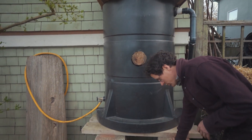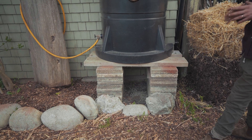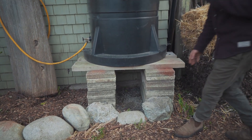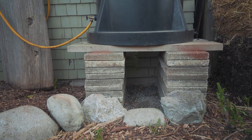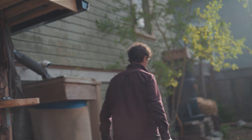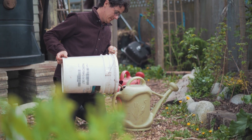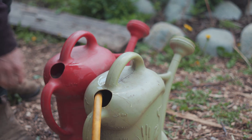You're going to need a good foundation for your rain tank. If it's a small tank like this, that could be just road base or gravel. In this case we've raised it up with some bricks and a couple of boards so we could have a bit of gravity feed. One thing about gravity pressure is that you get only half a psi per foot of elevation.